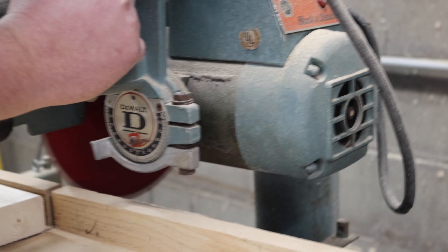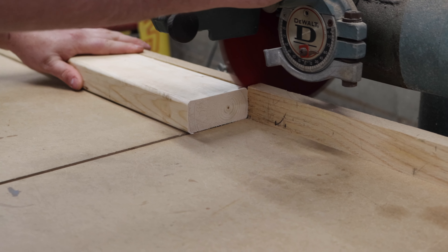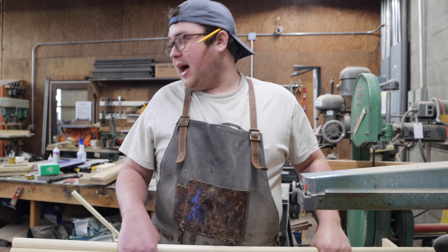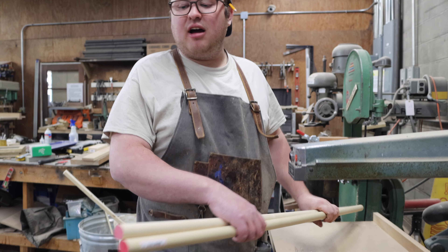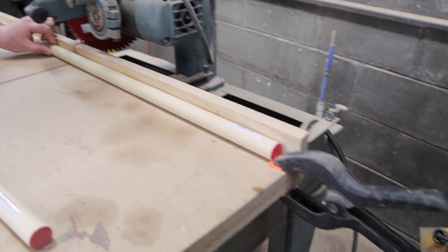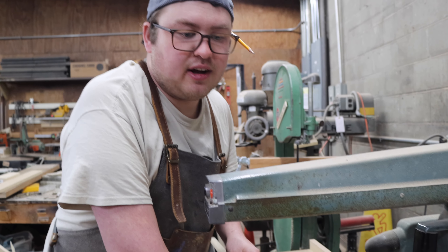You can see I'm a little bit off, so I'm going to take a little more off this one. We've got our dowel rods — we're going to put these one foot apart on our ladder, so we need three total rungs. We're going to cut these to around two feet. It doesn't really matter what the exact dimension is, more that they're all the same. We're going to use what's called a stop on the saw — this lets you repeat a cut at the same dimension. When you put a new dowel in, just bump it against the stop, cut, and you have the exact same size.